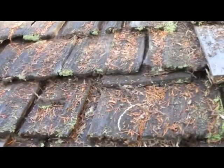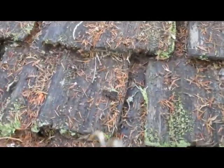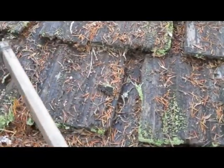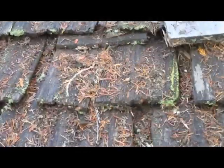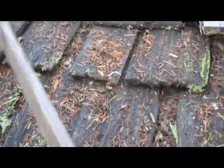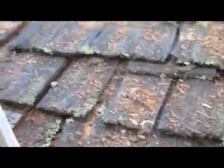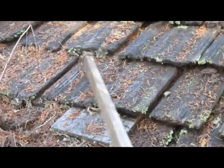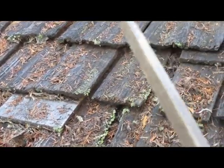You're just looking for things that have gone wrong and fixing them as you go. All this debris will wash down into the gutters. If you want to get rid of more of it you can just pound on the roof and stuff will work its way down. The main thing is just get the crud out from between the shingles, because that's where it builds up, rots, and then starts rotting your shingles.